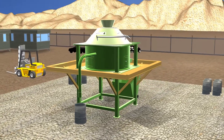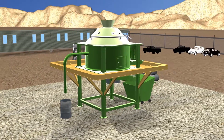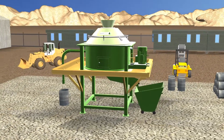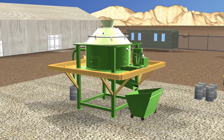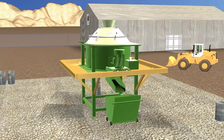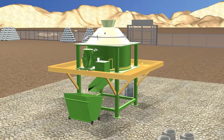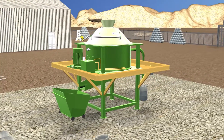The Environmental Solutions Vertical Centrifuge is designed to recover the liquid phase of the drilling fluid from drilled solids by exposing the latter to very high centrifugal acceleration forces, which improve fluid separation from the drill cuttings by further clarifying the costly liquid phase, which can be returned to the active mud system.